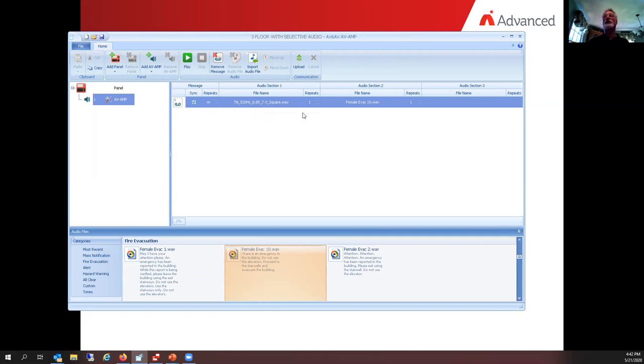But what if your AHJ says, no, I want you to play a T3, and I want you to play the message, the female voice, three times, and then after that, I want you to just do a 520 hertz forever. Don't stop, just keep playing the 520 hertz forever. Well, we can do that.